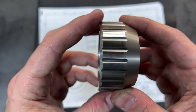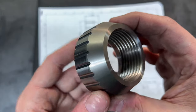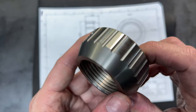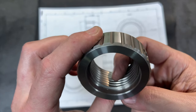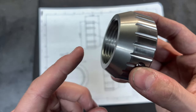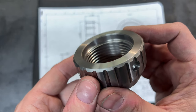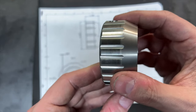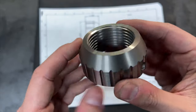There it is — the finished part. I think it came out pretty nice. There are a couple of things I would change if I were to make this over again. The first and most obvious is that I would cut the knurls in two passes instead of one from the start. The second and bigger thing is that I would cut the threads last — by cutting the threads before the counter bore and before facing off the other end, it did cause some mangling of the start thread on either end of the part. It may just take a little finesse the first couple of times it's threaded on, but after it's put on and taken off a couple of times it should sort itself out. Aside from that I'm very happy with how this came out and I hope the person I made it for will be happy with it as well.